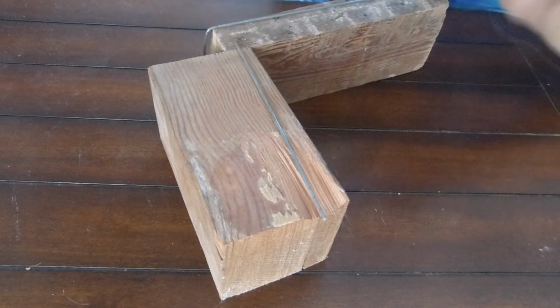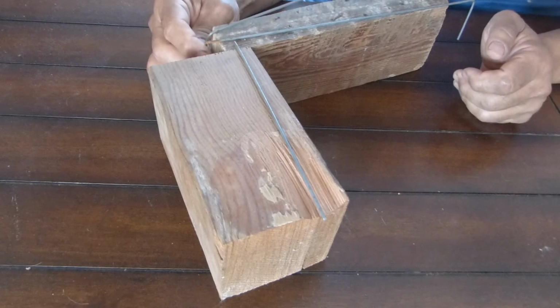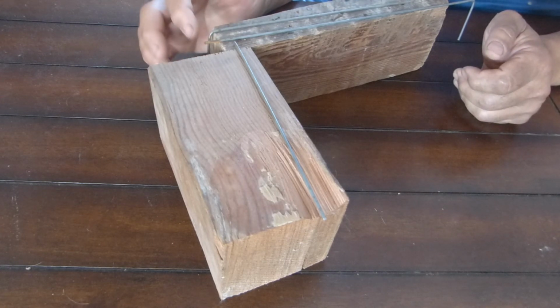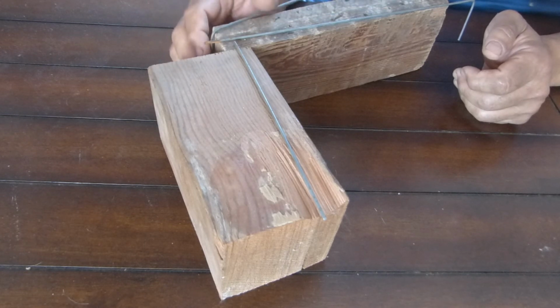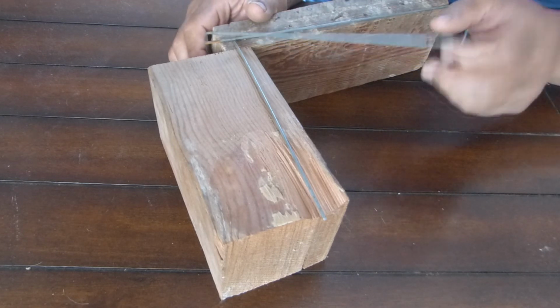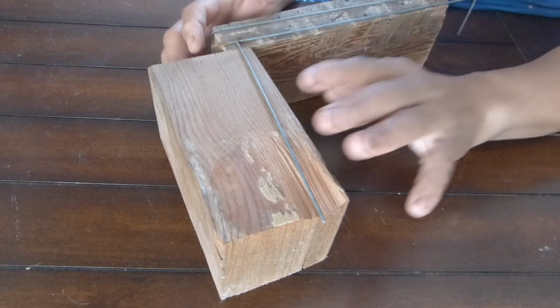When I do these pull out tests, all I care about is the pull out. The anchor is nice if you've got breakage. This anchor would be nice. The 90s, these L shapes. If you got some fractures in here, this does act like an anchor back there, a washer and nut, if you will. If you got breakage. If you don't have breakage, you've got good bond, you're golden.